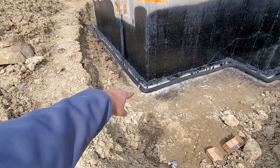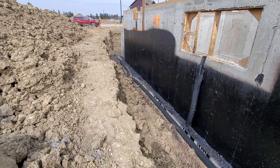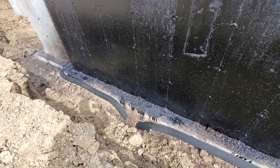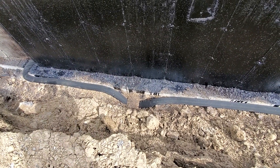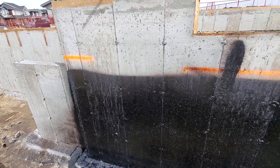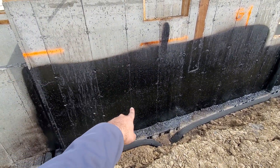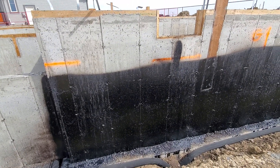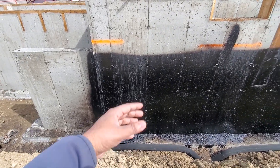This is a plot plan. On this they've given us elevations — how high the dirt has to be around the house — and we have to make sure we follow that. My excavators aren't going to follow this when they're backfilling, so I have to give them lines on all four sides of the house so they can use that as a benchmark. We use that pretty much throughout the whole construction process because even at the end when we're doing our final grading my landscaper will also use these lines.